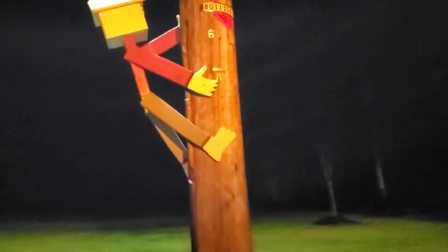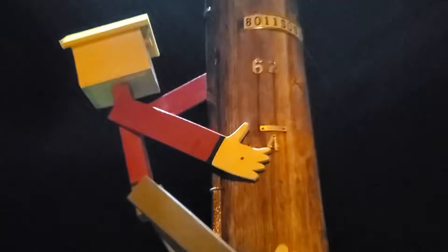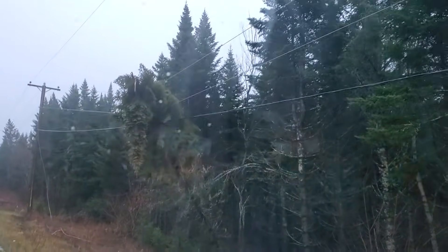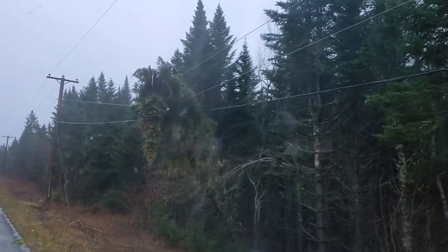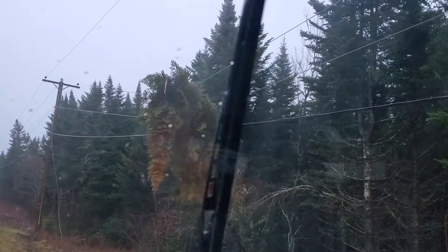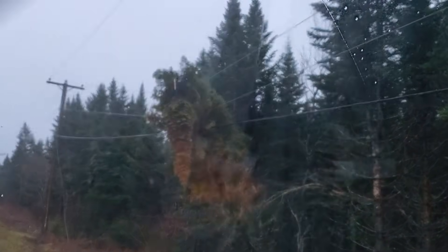So we identify the type of job. If it is a tap clamp that's feeding a sideline in any way, we have to advise our dispatcher and get a work permit on the line. The work permit basically tags the system so that anybody else in the area knows we're working on that line. On the drive out there was actually a crew working on the lines — if there was any trouble in that area I'm supposed to be notified. That's why you always tag your switches; you never assume that just because you're the only one out in the area that no one's going to be coming along behind. I noticed three switches open, there's a tag on the pole, and eventually I caught up to a crew working — there was a phase down behind us. We'll physically tag the poles in the field; the dispatcher will tag the switches in the system — that's protection to make sure everybody knows where we are and what we're doing.